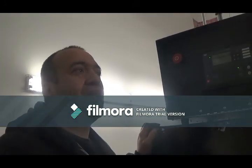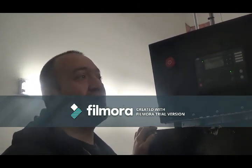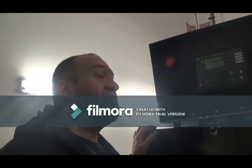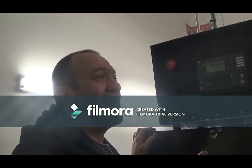If you do a transfer, if you want to run it for a day, the whole day, or until... But no, this is gas. That's the good thing. It's gas. Yeah, you can run it for days as long as you have load. They don't like to run without load. So keep it within 5 minutes. And the ultimate thing, if you run it 20 minutes every day for no reason, you're just wasting fuel, because although you have unlimited supply, you're still going to pay the gas bill.